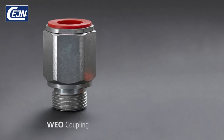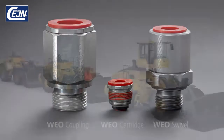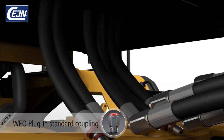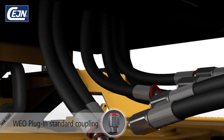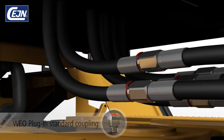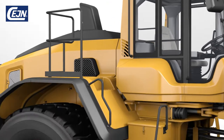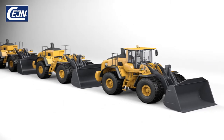Let's take a look at three applications where Veo products are the best solution. With this application, safety is the major focus. In the confined space between chassis and cabin, the operators have to carry out hose connections with a heavy cabin hovering over their head — a very exposed situation. Users of screw connect fittings always have the challenge of achieving correct torque. Imagine performing this task with no room at all for tools. With Veo, you can work quickly and avoid leakage problems, since all you have to do is plug in.